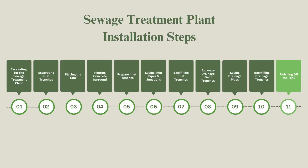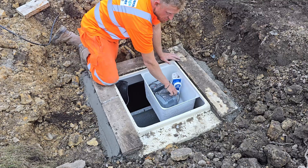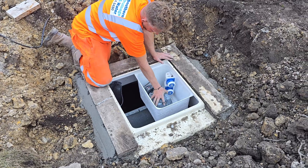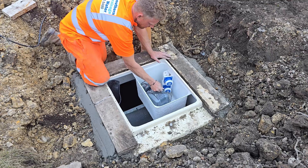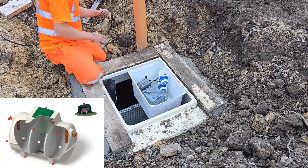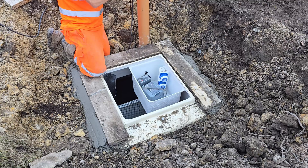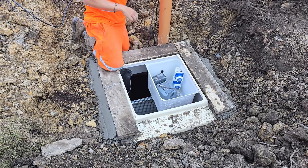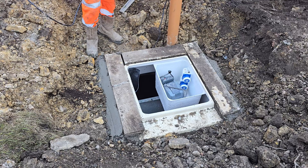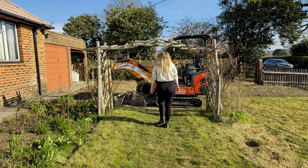With the tank installed, we moved on to the finishing touches. Since the tank was placed quite deep into the ground, we built up the access area with brickwork for added stability. Because of our clay soil and drainage field setup, we opted for a pumped outlet system — a gravity-fed outlet simply wasn't an option for us. When it comes to compressors, there are two options: one housed externally and one housed within the tank itself. While external units are believed to last a little longer, we chose the internal one for its lower noise pollution, which is a big plus given our peaceful location. The electrics aren't fully connected yet, but once done we'll properly test everything. For now, the hardest and dirtiest part of the job is officially done.